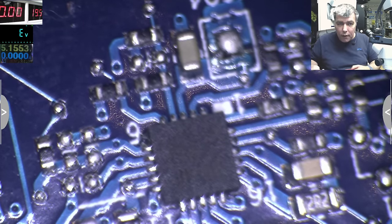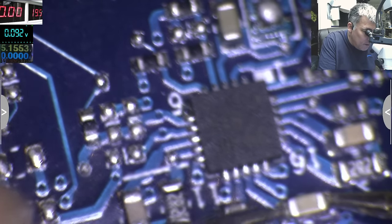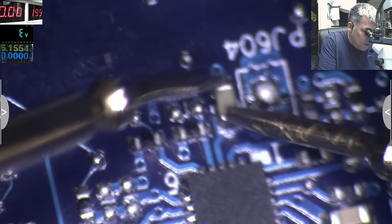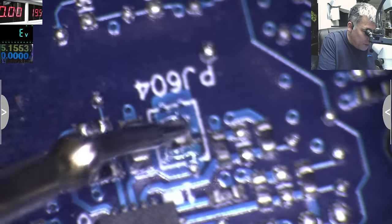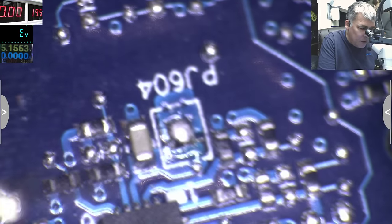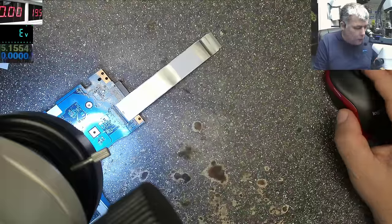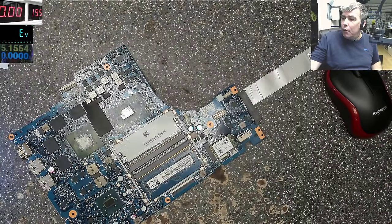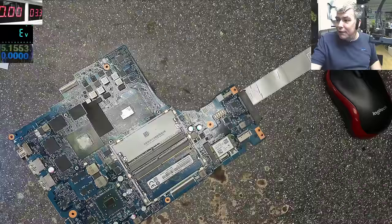Let's try to see those capacitors connected to ground. I don't know which one is outputting 3.3. Yeah, this is 0.0. This is not normal to be 0.0. So probably this is the, and we have a jumper here. Obviously this is the output, not the 3.3. Let's say we didn't find the 3.3 volts power supply, and that will come with 3.3 on the BIOS chip. That's a power rail, pin number 8 is a 3.3 volts power rail, yeah, and let's see what is getting hot.